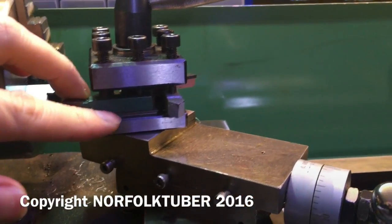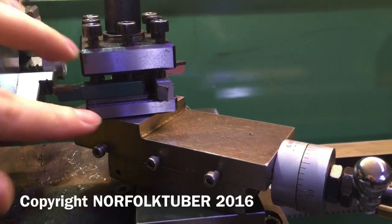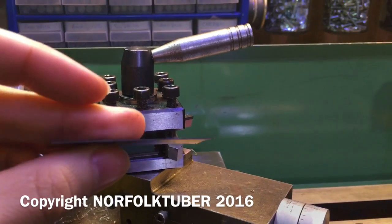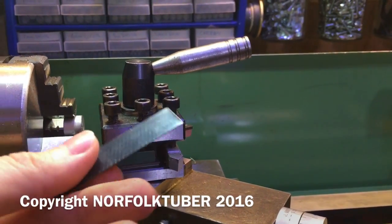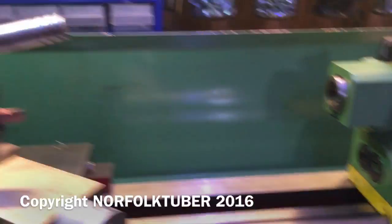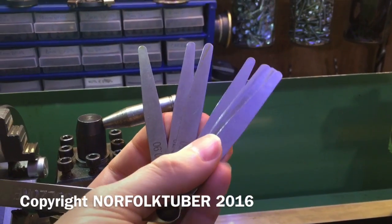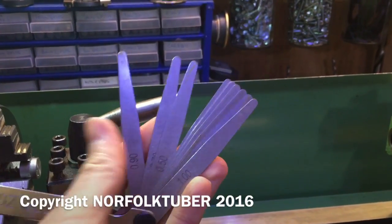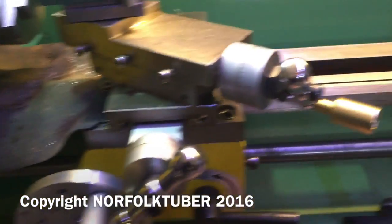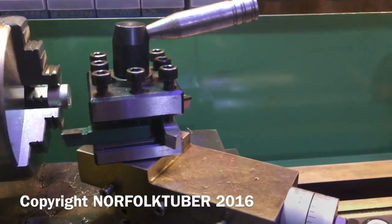The bits I actually use underneath here — I've got bits of pop can and also bits of steel banding, like what you would wrap crate parcels up in to hold them together in shipping. And there are also parts of feeler gauge in there as well to get the tool dead centre. So it can be quite time-consuming actually taking these tools out and then putting others in.